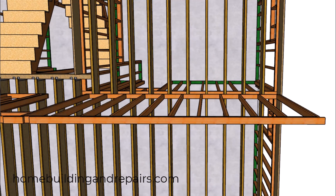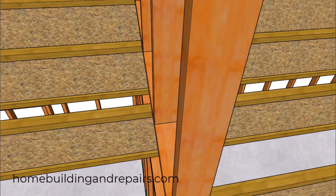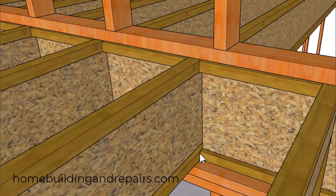Keep in mind that a structural engineer could provide you with different details altogether. In our first example, we are going to use the TJIs themselves and cut them into blocks. Even though I couldn't find any information on where the blocks need to be located, I like to line one side of them up with one side of the wall framing. The reason for that would be to provide electricians or plumbers with some spots they can drill their holes through without damaging the blocks.